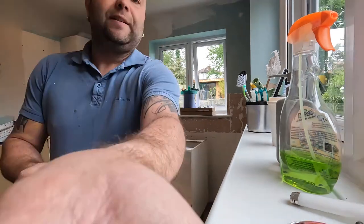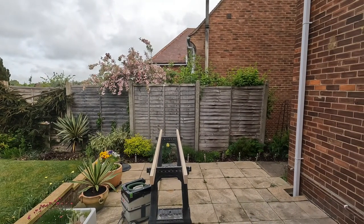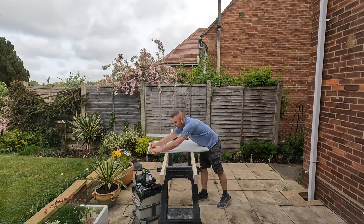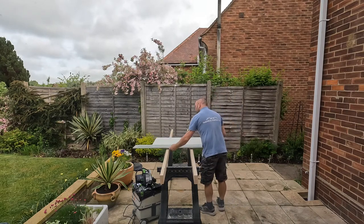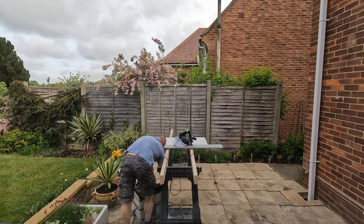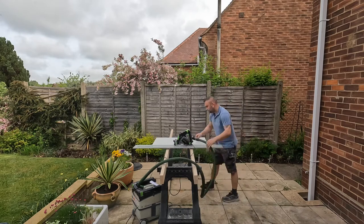Because we needed to shift the second unit about 20 millimeters to the right, we inserted a filler panel of about 16 millimeters between the first and second units. We cut this filler panel the same height as the unit — we did not put it straight on the floor, which I'll explain shortly. For cutting we use a track saw, which is a great tool for kitchen installation giving flexibility, speed, and very clean cuts. If you don't have one and you're in the trade, it's a game changer.